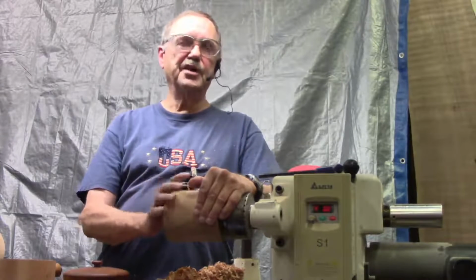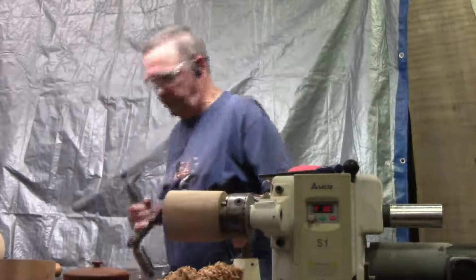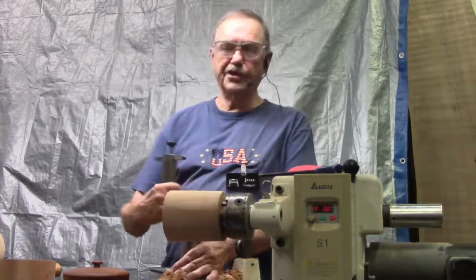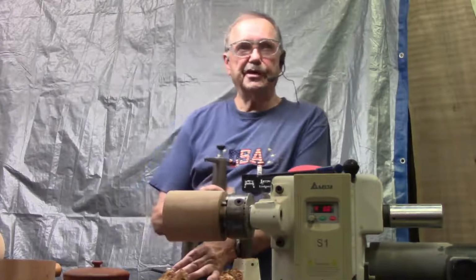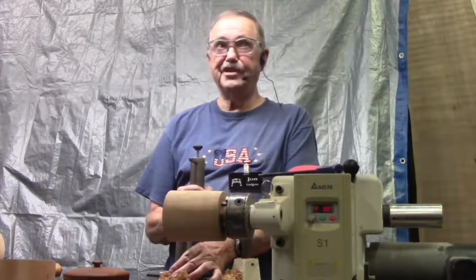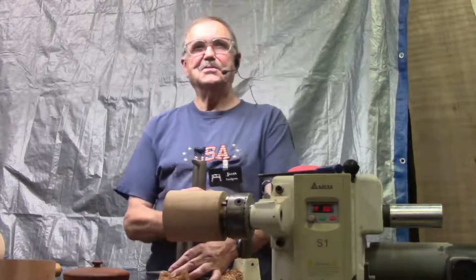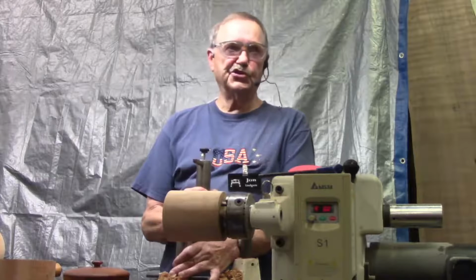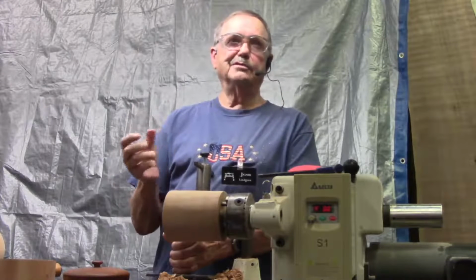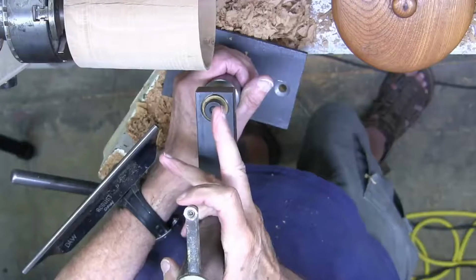And once you've done that, you use this outside diameter, and with the ball jig, you center it right under your ball. And so when you're working back and forth, nibbling off the outside till you end up with a round ball, you're doing it centered on the middle of that ball, which should have equal amounts hollowed out on each end, if you're lucky. So a lot of it is making sure this is centered. I'll get it on there, I'll start it, I'll measure it, I'll move it, I'll measure it, I'll move it again if I need to get it perfectly centered so that I'm doing a circle right from that joint line.